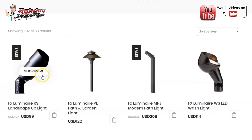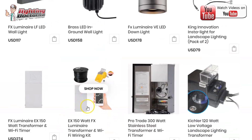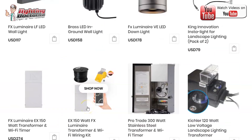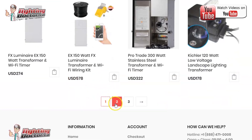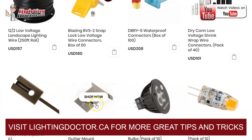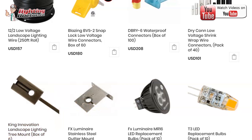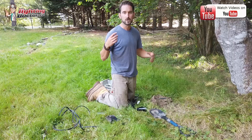Terence, we can definitely customize the kit for you, or you can take those suggestions and add some of these different lights to your shopping cart. A transformer and wiring kit like this would be perfect for a job of that size — you get 250 feet of wire and a 150-watt transformer which would easily handle those lights, plus all your waterproof connections. The only thing you might need to add is one of those gutter mounts for the second story lighting, which you can find on the website. If you have any questions, I'm happy to help.